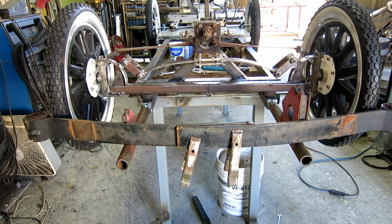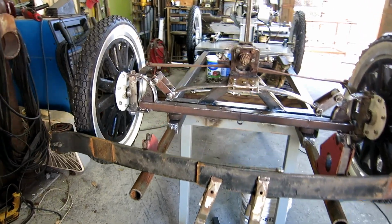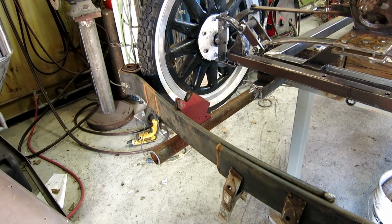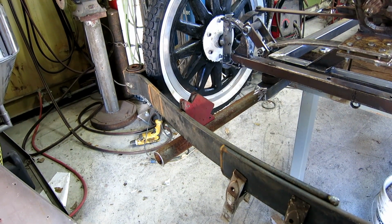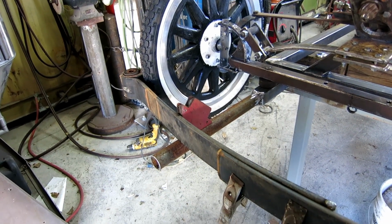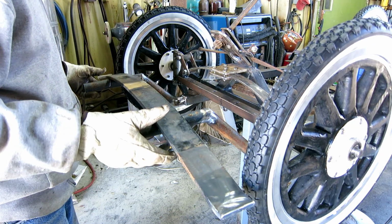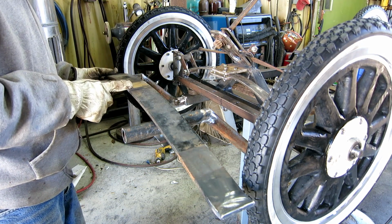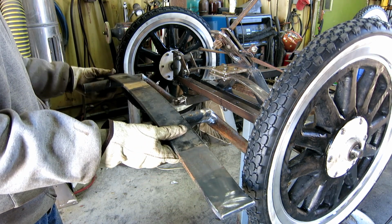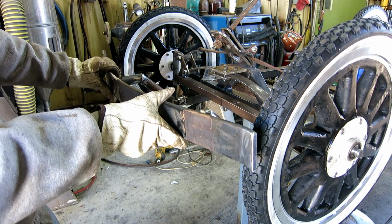I'll have to heat it up and soften it up a little bit. And I'm gonna have to cut these pipes at maybe a 45 and raise them and then cut opposite 45 and level them back out again. Would have been a lot easier on the bench, but they're in the car now, so that's what we'll work on. Okay, so I offset my pipe to get it up about 5 inches. And I cut the bumper again to make it smaller. And I cut the big circles off the end. And I held it up here until everything looked good. It's kind of hard to tell, actually.